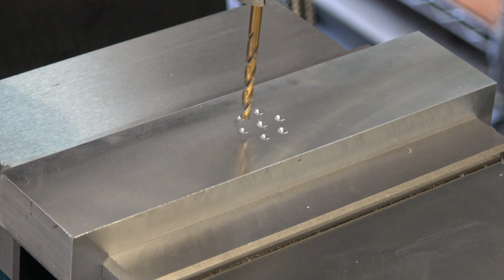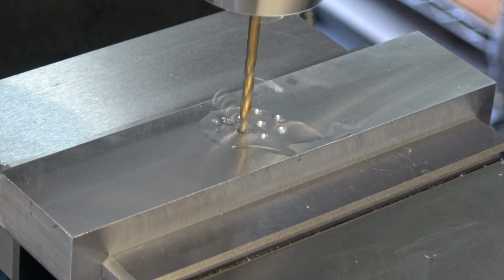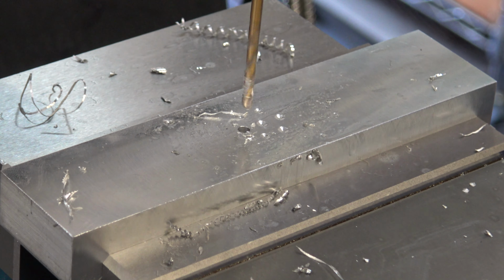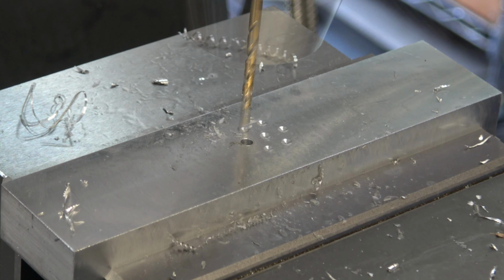I used the hole setting on my DRO and set it for 6 holes that would represent the 6 corners of the hex. I had to recalculate the radius dimension to compensate for the thickness of the drill bit. I like the sound feature that came on the new DRO on the new milling machine. It beeps to let you know that you're getting close to your next position.